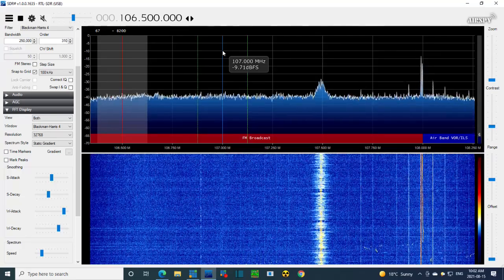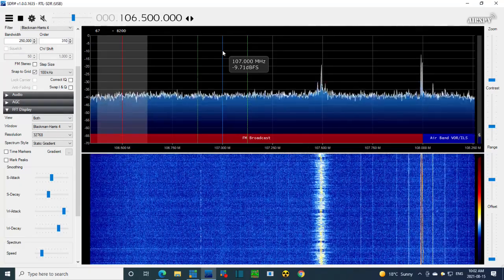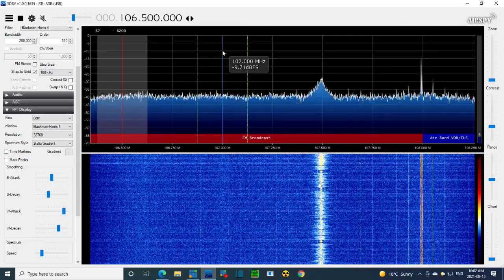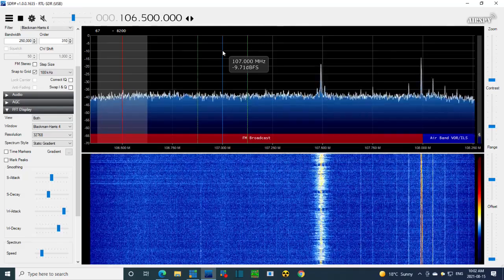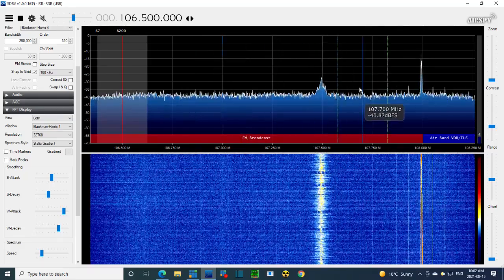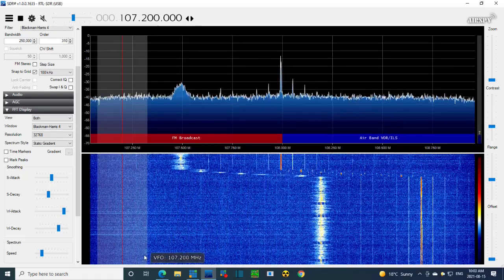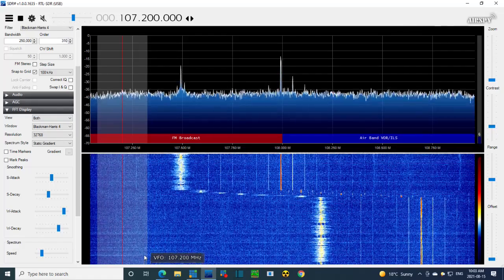Now we'll try to, no, that's not right. This is coming from the marker generator. Now we'll bring in the sweep here. See what happens. I'm going to change my SDR screen. I'm going to move it so that 108 is roughly in the middle of the screen here. Okay, can I reduce the marker?